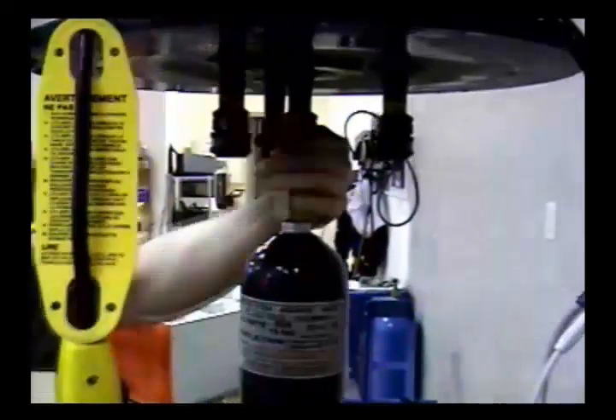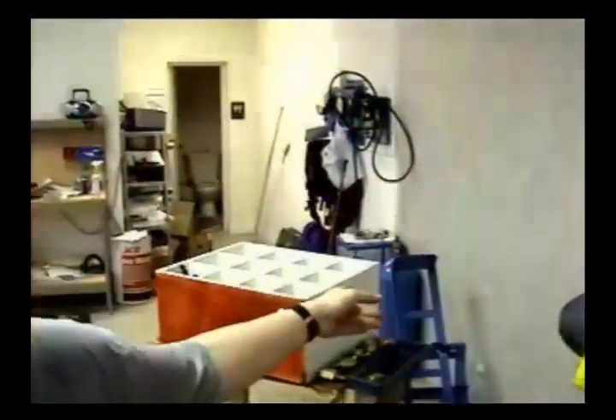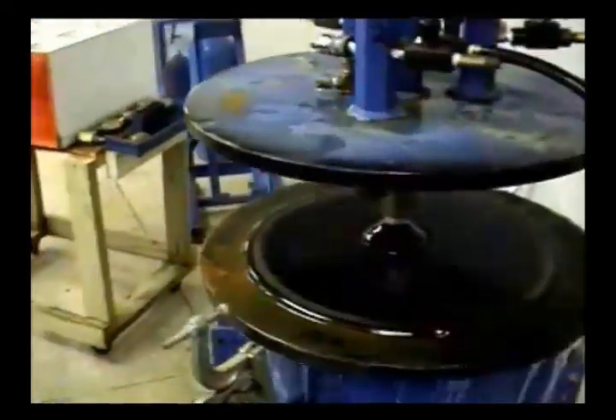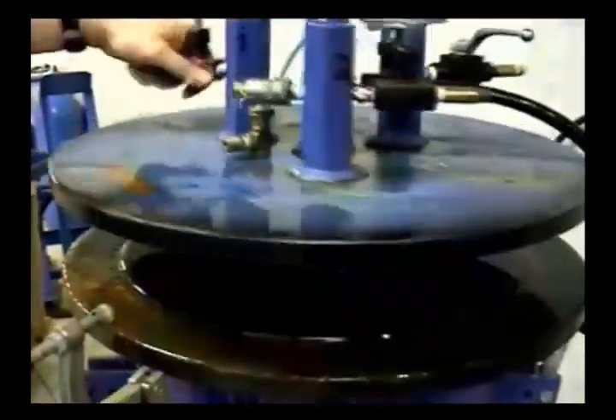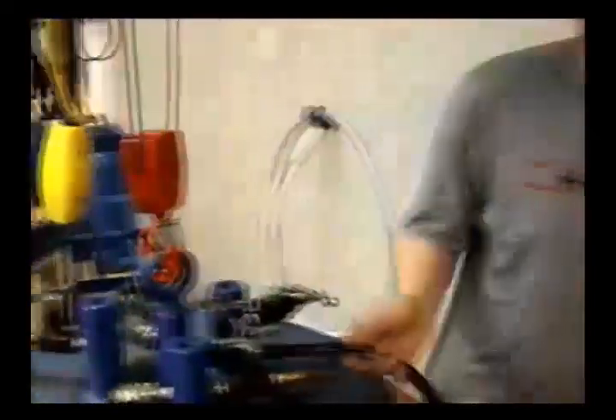For the hydro test we have an adapter that screws into your tank. Every day before testing, we make sure there are no leaks — we use a larger tank and run our normal tests. We have certain criteria we've got to check every morning: we test the hose system for leaks and make sure it's calibrated. After locking everything down, I pressurize the whole tank and get all the air out.